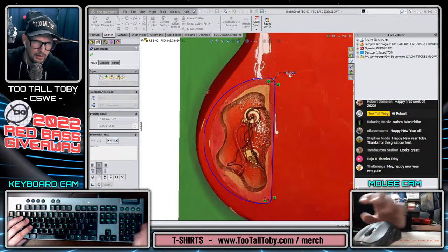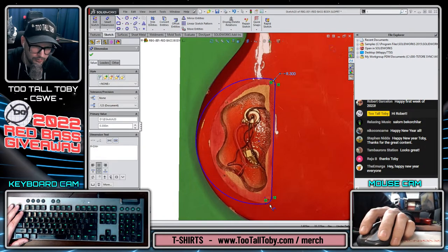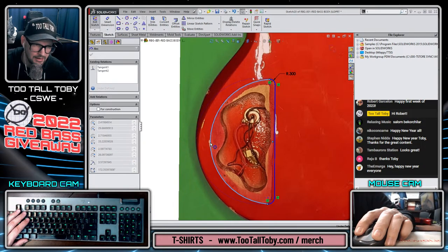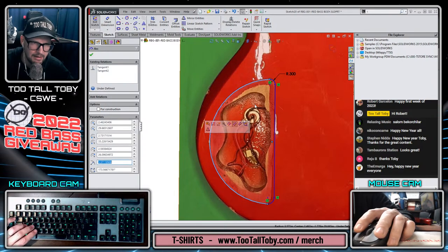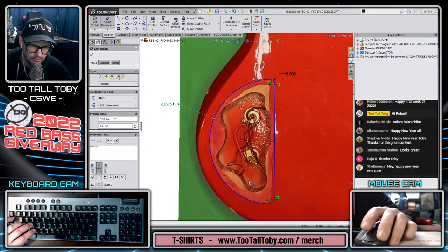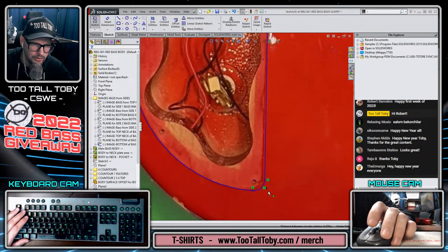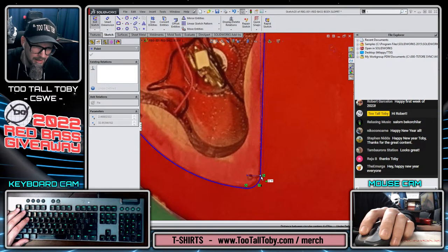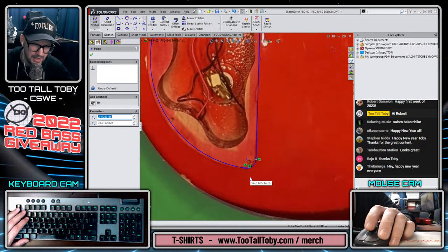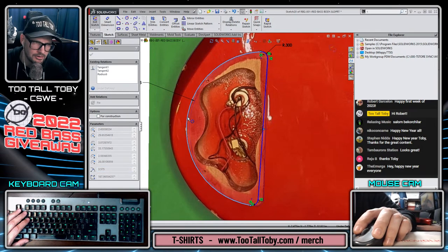get this geometry looking kind of close to what the physical model looks like just by dragging, really. You can see how quickly I was able to get in there and just create that pocket. And after the fact, I could certainly go in and add some dimensions to kind of lock this thing down, maybe make these two sections here equal. And I could also use physical dimensions and measurements to figure out where certain key features are located. Like, I could take care to dimension the hole pattern here, because the plate that goes over this electronics cavity is going to need to match that hole pattern.